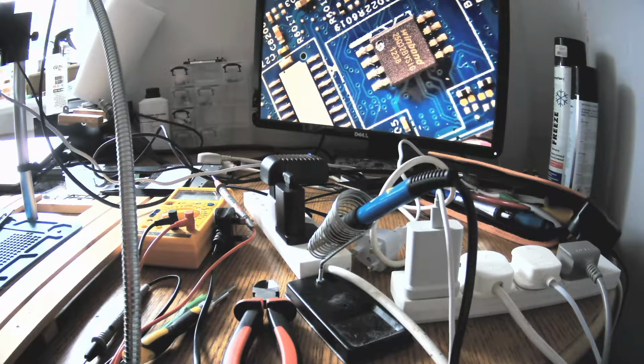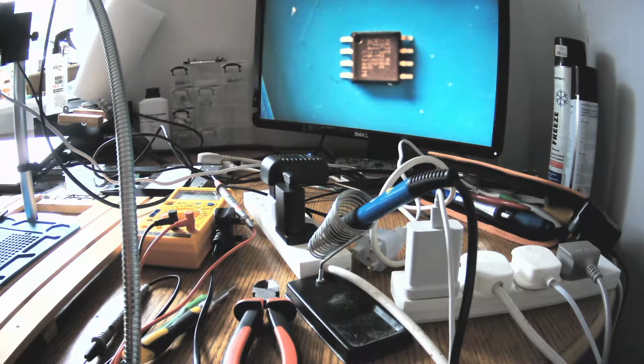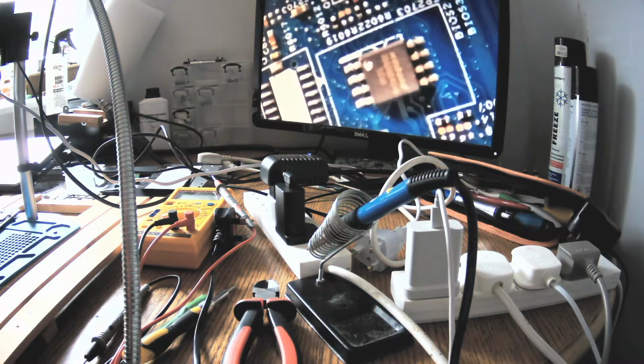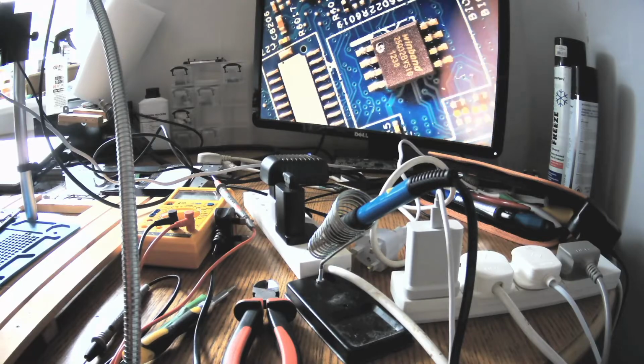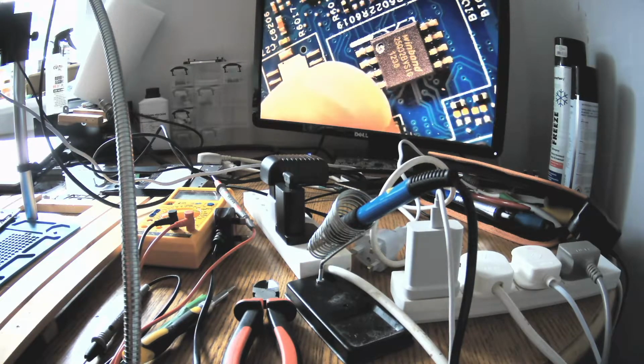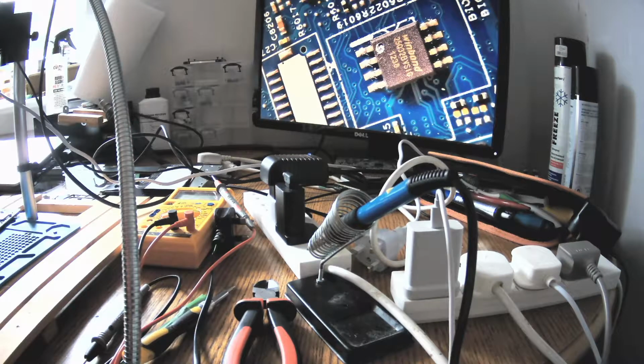VSIG, yes, so we got it, and we've got a second BIOS here sent by a person I've ordered it from. I didn't want to go through the programming of the BIOS which I have here, because I've ordered another programmer from China, and my programmer only supports the higher voltage. I don't have 1.8 volts. So I've decided I'll just order this one and that's it.